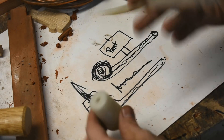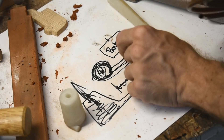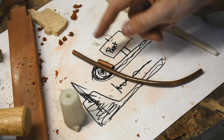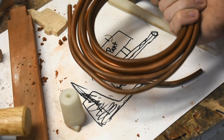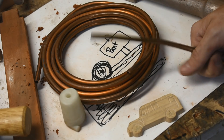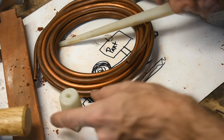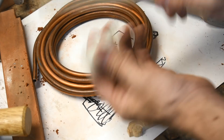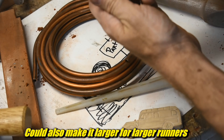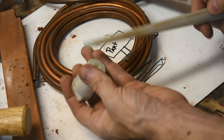I recommend you go print these from MyMiniFactory for free. Go to a hardware store, get some quarter-inch pipe. You can cut small pieces for little offshoots, cut long ones, make curved ones — you can mix and match and reuse over time, so one roll should last you a long time. The extra copper you can melt or whatever. If you're overseas and you don't get quarter-inch copper pipe, I'm sorry — anything similar works. If you print these, you can probably scale them up or down a certain percentage. If you scale both of them the same percentage and the pipe fits in there, then it lines up. Hope this helps and happy casting.